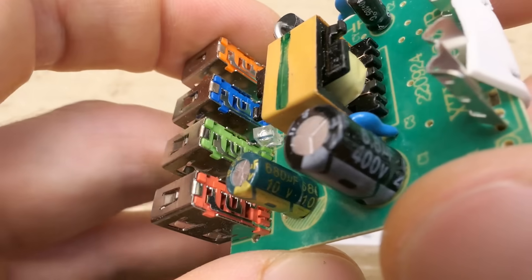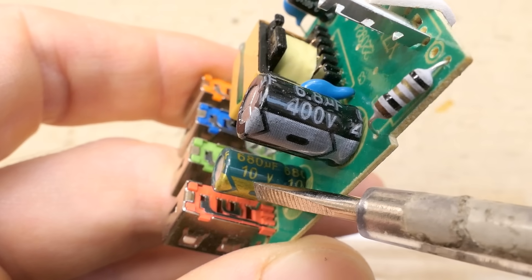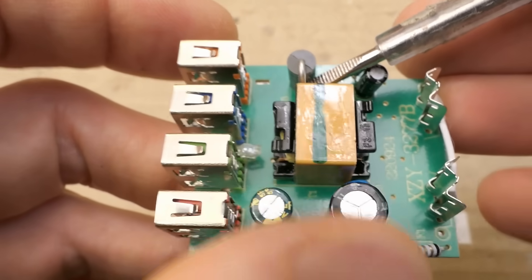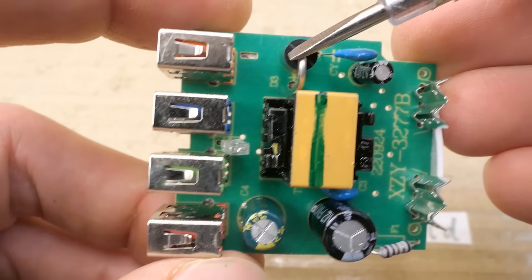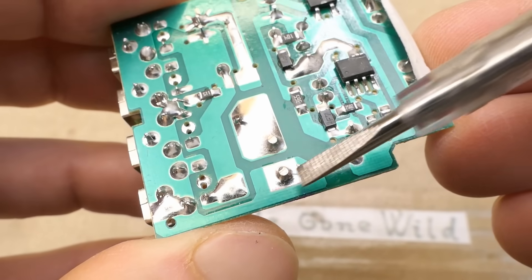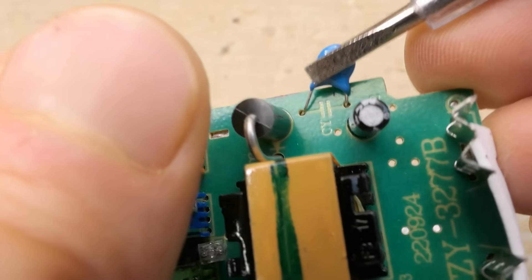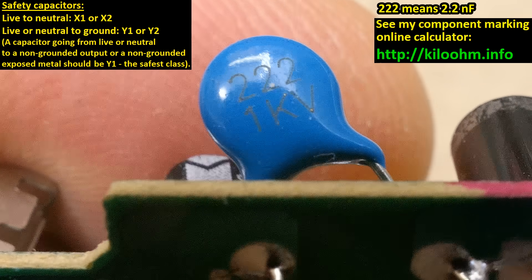There is not even any discharging resistor for the secondary capacitor, which is also quite tiny. The footprint on the board is much bigger — this is just 680 microfarad and it's just 10 volts rated, which again shows it was never meant for 12 volts. Here is the rectification diode on the secondary side, which is just a normal diode — lossier than a synchronous rectifier used in modern chargers. And the interference capacitor — that's the only interference suppression: this capacitor between the primary and the secondary side. And of course it's not a safety capacitor, it's just an ordinary 1 kilovolt capacitor, 2.2 nanofarad.